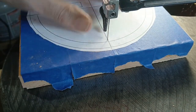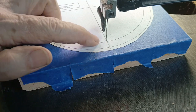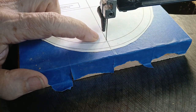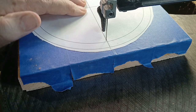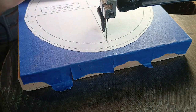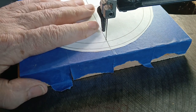I've got all the blanks mounted with the patterns. This is the center ring section — it's got the cherry and the two and an eighth inch pieces. I'm going to cut the inside first and save that center piece for the very top part of the vase. I'm going to put this accent ring up to the top too. So I'll cut the inside first, save that, and then cut the outside. This is cut without an angle, using a number 5 blade. We've got two blanks and have to make two sets of rings with the walnut.